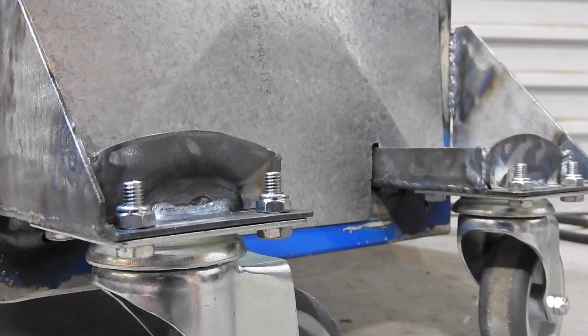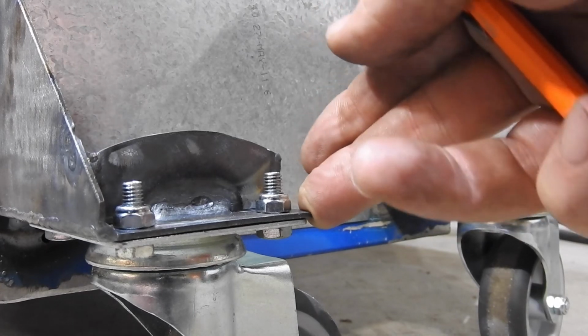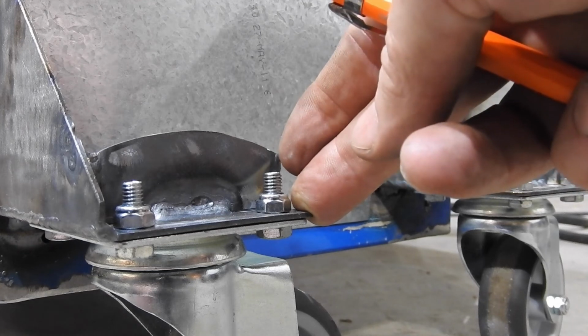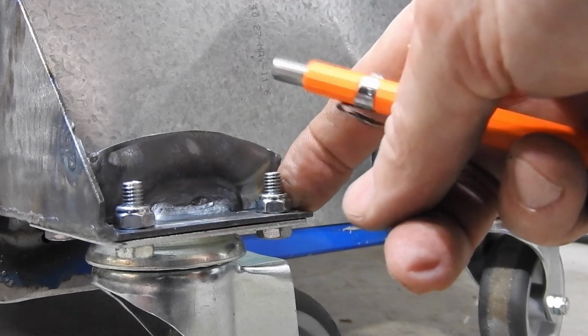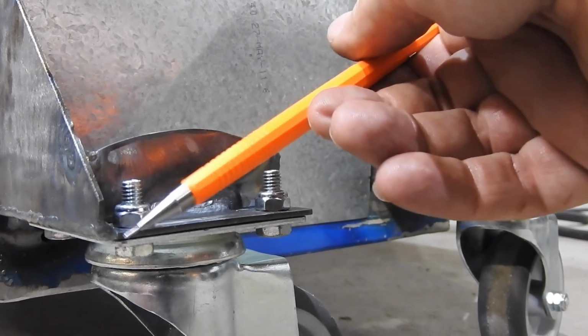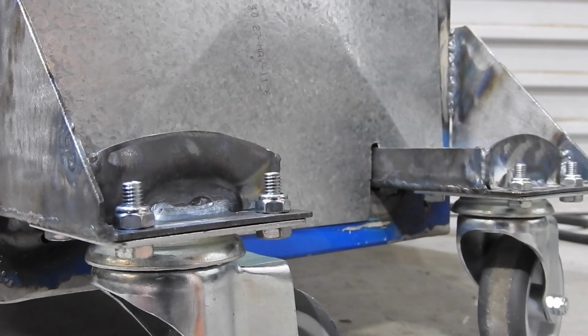So that's a couple of, I guess, applied tips about design of weldments, of brackets, of reinforcings, of gussets, of all that sort of thing. Firstly, you don't need to have weld absolutely everywhere, and secondly, you don't need to have sharp corners, and they'll cause you problems with your welding. So that's a few welding tips which might be of use to people.